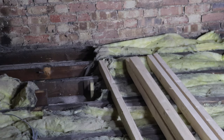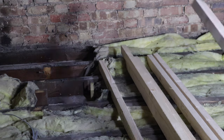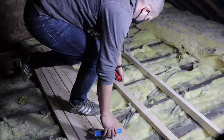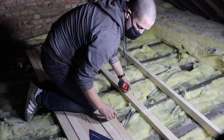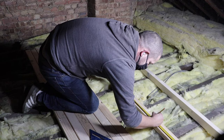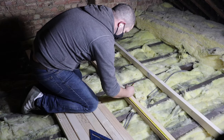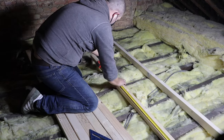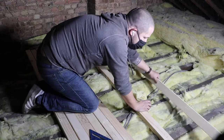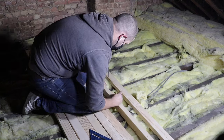Now start getting my timbers in place — well, up into the loft space anyway. And then we can start marking out for our front and back pieces. I was going to work this out but it actually worked out quite nicely just doing it at 400 centres. That worked out well, and then that falls in line with the join on my boards — my decking boards.